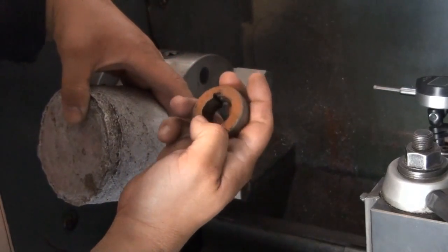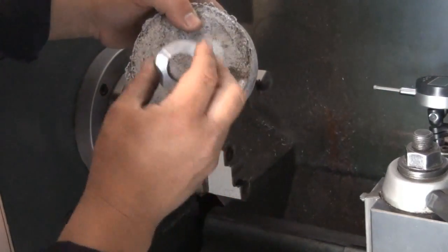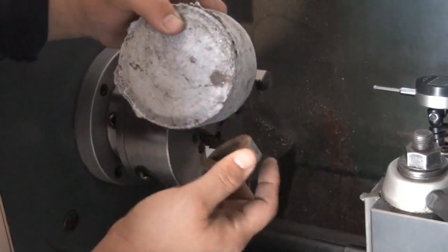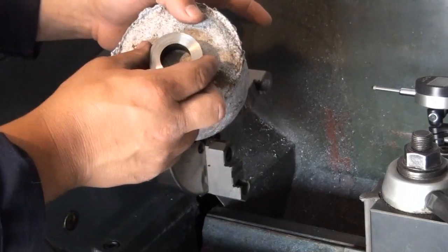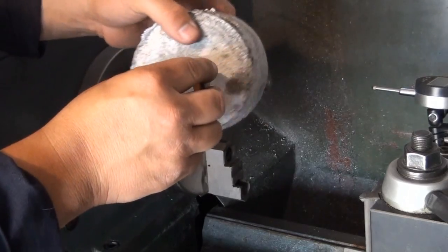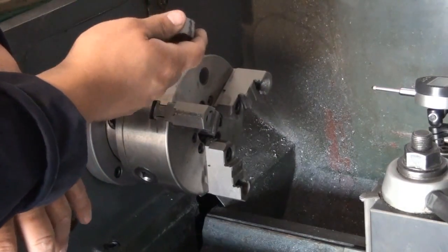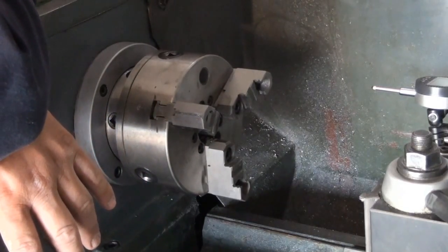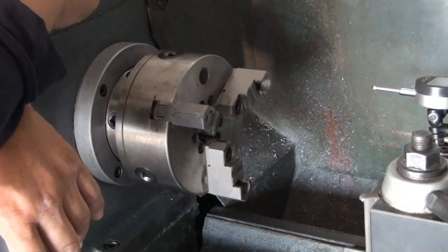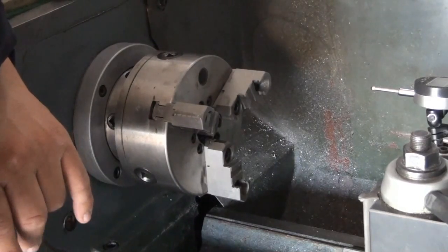On the other side I'll drill and tap some quarter-inch threads so the pulley will be removable. I'll always have the collar on the engine and I won't have to take it off — I can just swap out different size pulleys. I would have made a whole solid pulley, but I don't have a broaching kit or a keyway cutter. Once I get that equipment I'll have no problem making full pulleys with cut keyways.